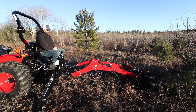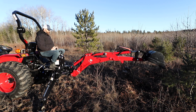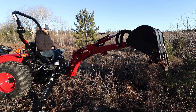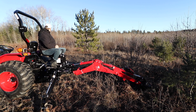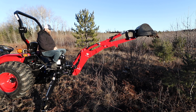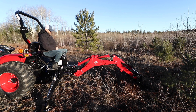Here we're starting with some easy scoops — this is grass with sod, sand underneath in a sandy loam, and it's cutting right through with no problem. The only real resistance is roots. This backhoe can cut through probably a two inch root without you even feeling it — just the down force from the bucket cuts right through. Over that size you'll start to feel it and may need a couple of curls. Around the five inch mark is where roots are too large to easily cut in one or two scoops — you have to be more strategic or dig further away and cut into it.